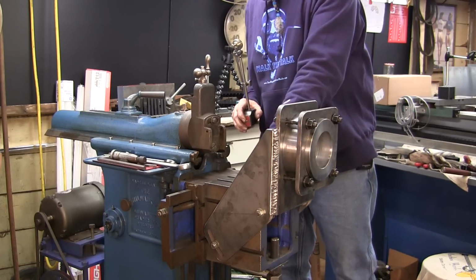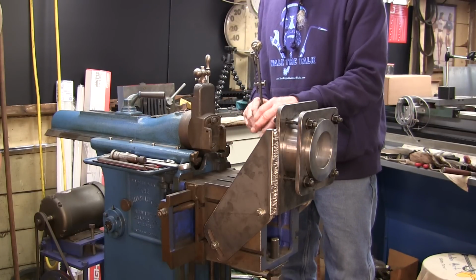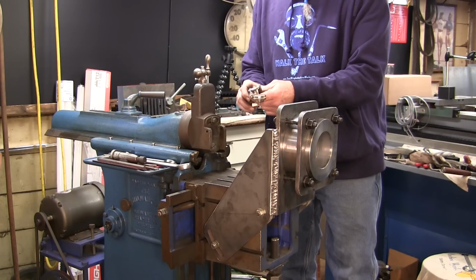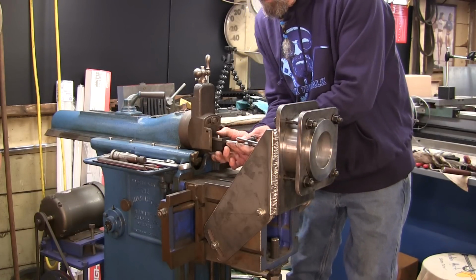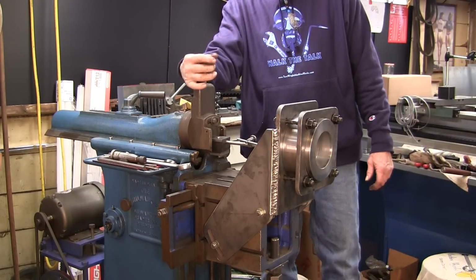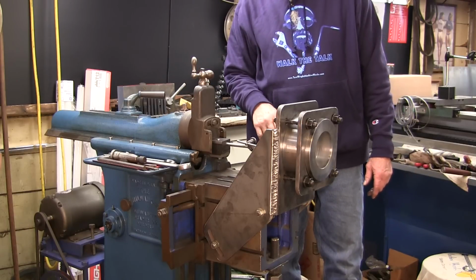All right, and that was actually kind of an easy way to pull that out, and I want to be able to set that bit up just right. And actually, I could pull it out and work it instead of setting things in tight bores and tight spots. All right, we have just a regular Starrett mag base right here, and my Starrett button head on here, and we're just gonna put this right down in here like that, and then we're gonna use the compound to go ahead and dial until we get our touchdown and get our button to make contact, which it's making contact right there.